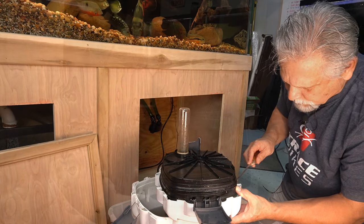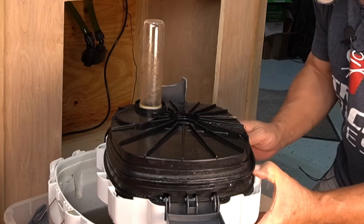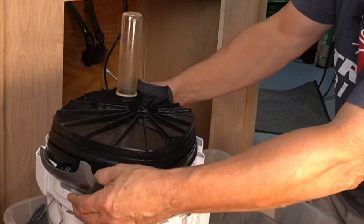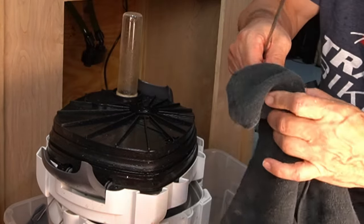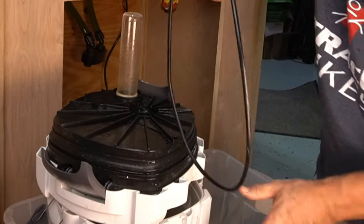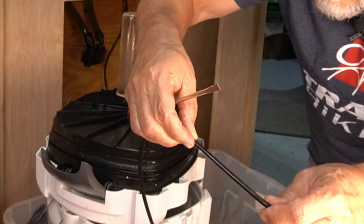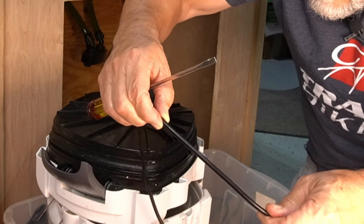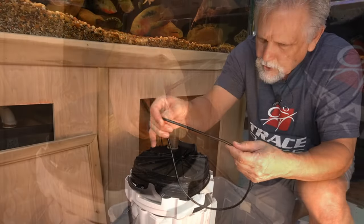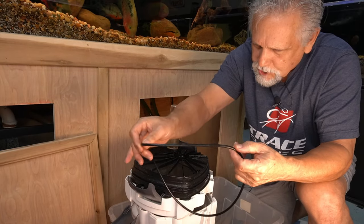Let's take a look at this O-ring. Now be really gentle with these O-rings — don't cut or stretch them, just take them out gently. You can see here, let's inspect this thing. Whenever you clean them, don't pull on them because you'll add length to them and then they will not fit right. I'm not really seeing any real damage or flat spots. I replaced it a couple of years ago and I keep them lubed up, so they actually wear really well.